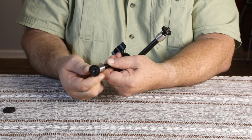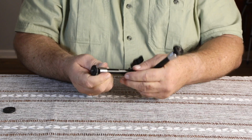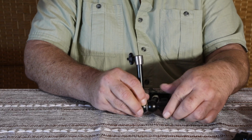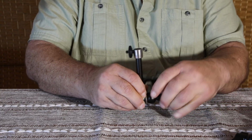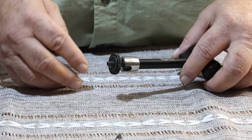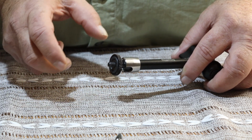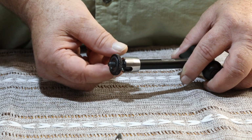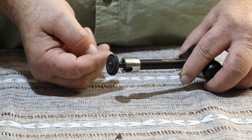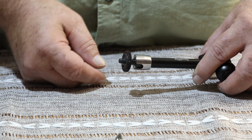You can't turn the screw with the knurled handle anymore. You would have to rotate the whole mechanism to get it to screw. And this will give you 360-degree rotation from the screw. So you can screw it, 360 degrees, this will turn when it's loose. So the screw and the ball are machined as one piece. The threaded, knurled, rotating knob on here will screw in and out like so to help you tighten this once the screw is in as far as it'll go.